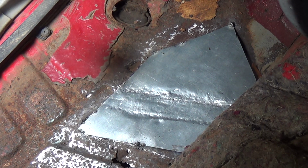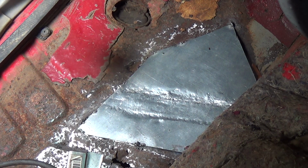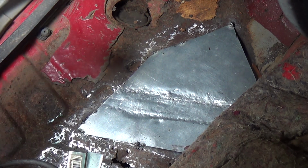Alright, I'm almost there. The ground clamp, let's say, ground clamp there. I just put the ground clamp on where the seat would bolt in, on one of the seat bolts. The wire settings, I've got it on A for voltage, and let's see, about at 2 for the wire speed. Alright, so let me get something for the old knees here. Get my trusty welding screwdriver here.